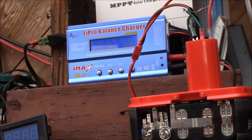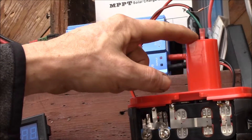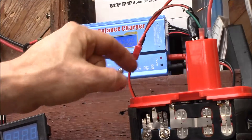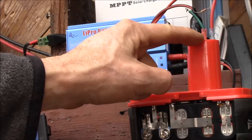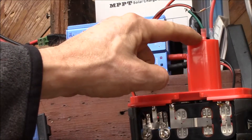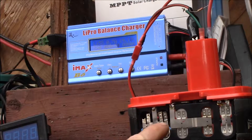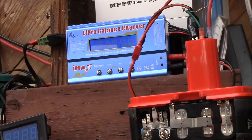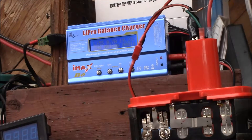Just to show you how peculiar these batteries are - I tried again on the left terminal and got the same cell connect error message. I moved the pull-up resistor to the right side terminal and now it's charging on that side. You can see the protection IC thinks everything's okay, it turns on, and once you can get that MOSFET on, the charging begins.